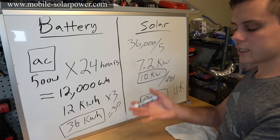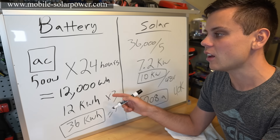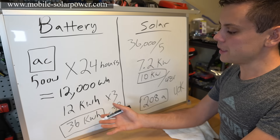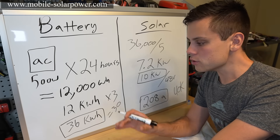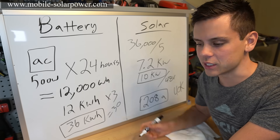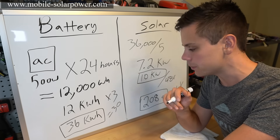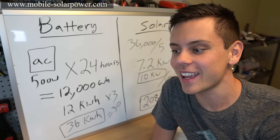So that's a very large system compared to the simple laptop example at the start. I hope you found this useful. If you know your load size and how long you want to power it, you can calculate any system instantly. It all comes down to volts times amps equals watts — once you have that, you can size any grid-tie or off-grid system. Leave a comment below and I'll talk to you later!